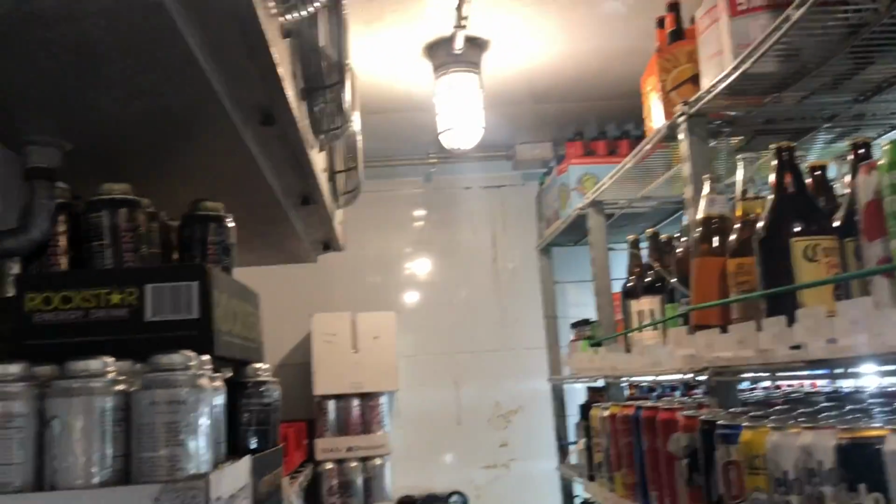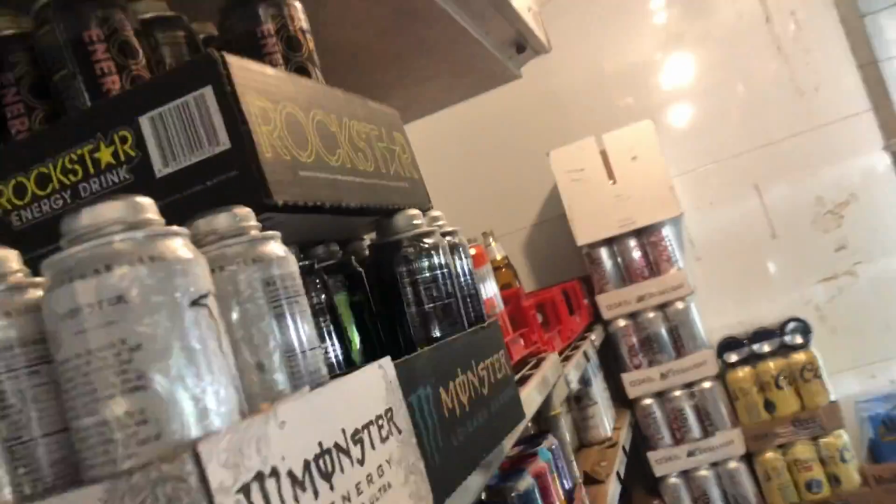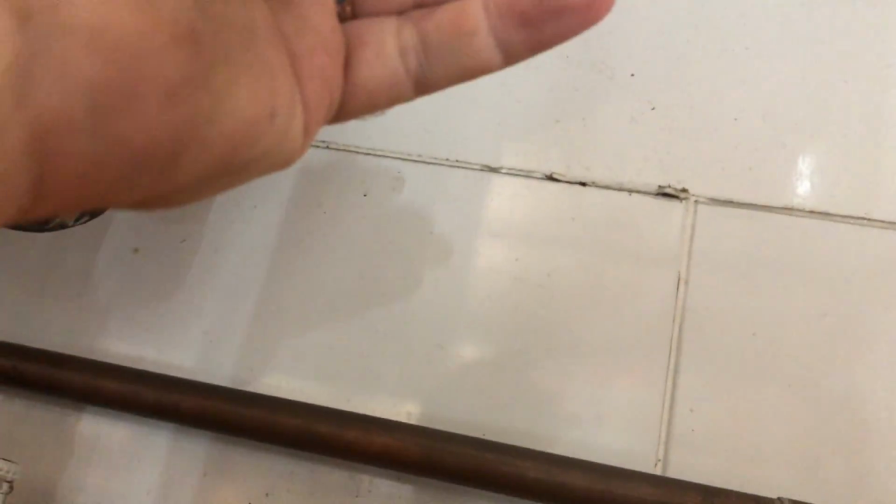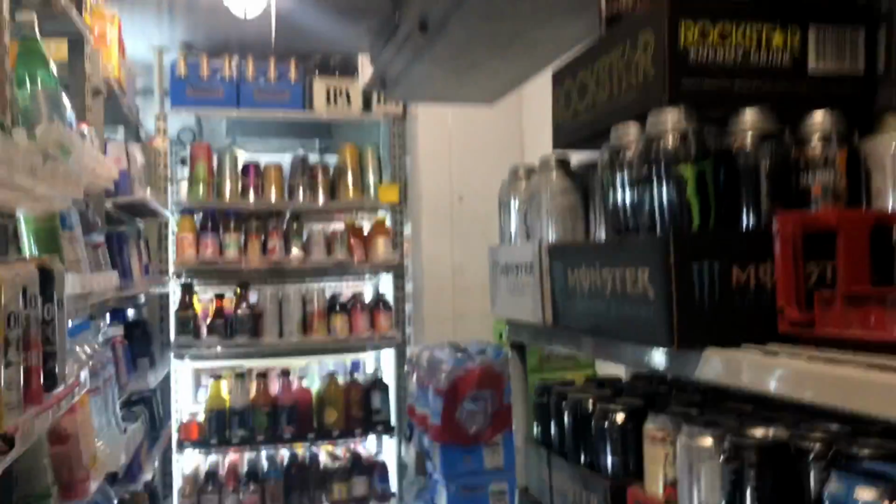Look at this cool sheet metal diverter to get the air over to this section, and the rest are going out front here. This thing's out. It's hot as heck in here, so we're gonna go up to the roof. The solenoid's energized. It's over here. It's the old box. And the solenoid's energized. There's no oil. So let's see what we got going on the roof.